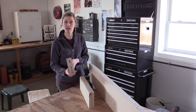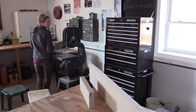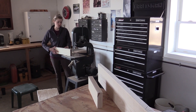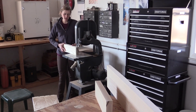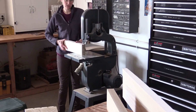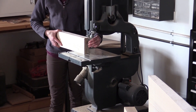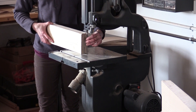So once you've done that, you can go to your band saw. Some people prefer to use a fence; however, I just prefer to tweak the blade a little bit. I do that by applying just pressure, maybe at about four or five degrees to the side, so that the wood that's already been cut is actually holding the blade in place where I want, and it actually makes a straighter cut.